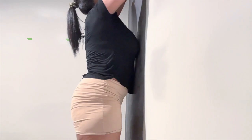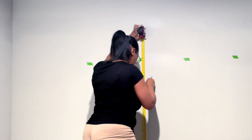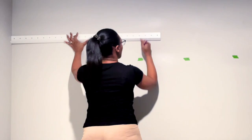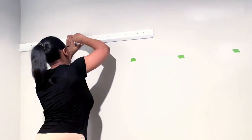Now that our accent wall is complete and looks awesome, we are ready to start installing the IKEA Aurdal closet system. The first step is measuring and marking the appropriate height for each closet panel. This will vary based on your ceiling height, but the instructions give you a range. Once the measurements are transferred, you install the cleats that hold the panels. I'm lining it up with the measurements I've made, securing it into a stud with just one screw, and then leveling the cleat before securing the other screws into the studs.